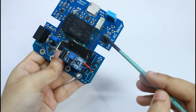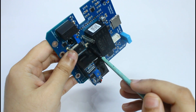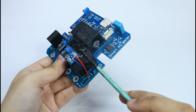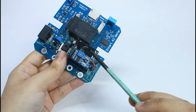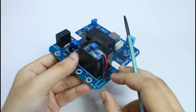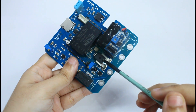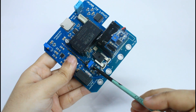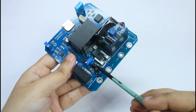An RGB LED provides visual feedback on the meter's status — such as normal operation, alerts, or errors — using different colors. A relay enables control of the power supply to the connected load, allowing automatic shutdowns in case of faults or non-payment of outstanding bills. The vibration sensor detects vibrations, adding anti-tampering protection by automatically cutting power if abnormal shocks or knocks are sensed. The Hall Effect current sensor measures AC current with high accuracy, essential for calculating power and energy consumption. A flame sensor comparator IC, the LM393, processes the flame sensor signal for reliable flame detection.